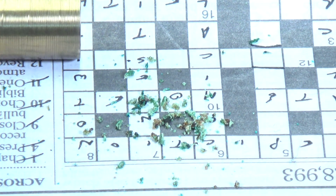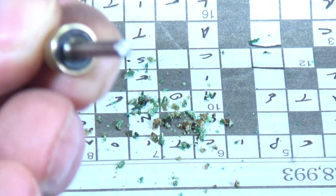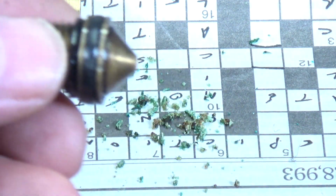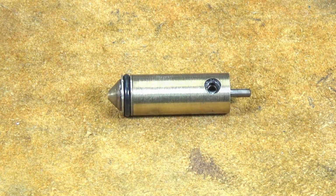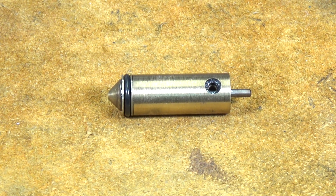So anyway, fortunately again, got a little O-ring in there, which I fitted on the 761, and that worked fine. So I need to put a little bit of silicone oil on that, and we can get it all back together. Oh, and I've got to obviously change the two seals on the end there. But yeah, we're pretty much all ready to go back together. So there's the reassembled air chamber with all its new seals in, and hopefully that will solve the problem. So now it's just a matter of putting it all back together.